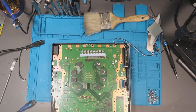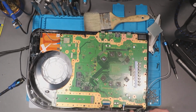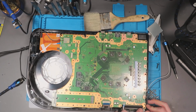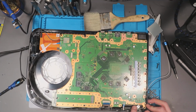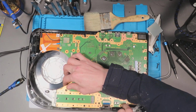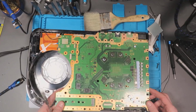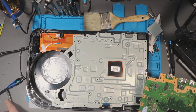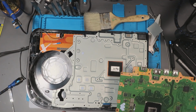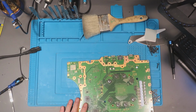So if there was a voltage drop, then I would say there's a short somewhere, but it's very doubtful because there's no voltage drop. So it's unlikely that we've got a short. So my initial feeling on this is maybe it could have had some liquid metal spilt somewhere and that's preventing it from turning on. That is possible. Well, that's nowhere near enough liquid metal for a start. Right, I'll have a look at the HDMI area in a minute.